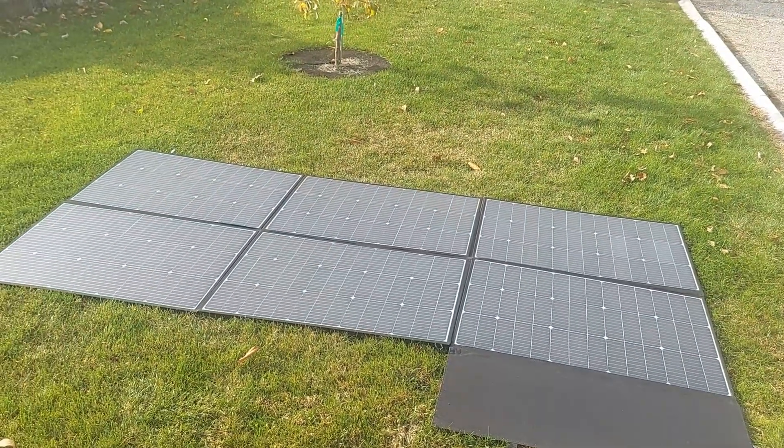The solar panel included with this unit is a 600-watt monocrystalline panel rated at 23% efficiency, which is about right — they're typically 22 to 23%, pretty standard in the solar panel world. It comes with a bunch of D-rings and loops so you could hang it off a balcony or mount it to a rack, giving you lots of options for aiming it at the sun. The panel is a 44-volt panel at maximum power and just under 14 amps, so 10-gauge cable is fine. At that voltage, you can run 50 to 60 feet of cable without significant loss, which is nice.